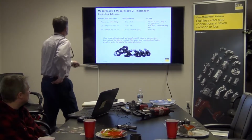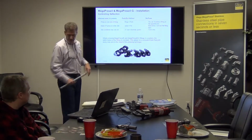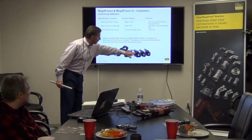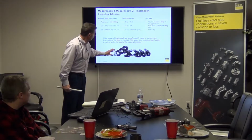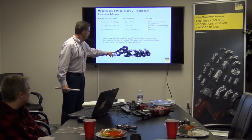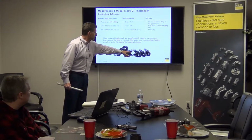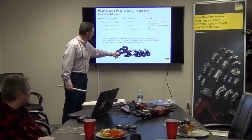And then there's your actuator that we don't have with us right now because my jaws are in Nazareth, Pennsylvania, but there are 2 different styles. There's your scissors jaws and there's what they call the clamshell jaw. So these are for the larger pipe diameters. These are for the 1/2 inch up to 1 1/4 inch. 1 inch. 1 inch, yeah.